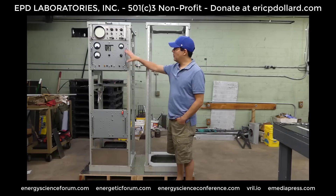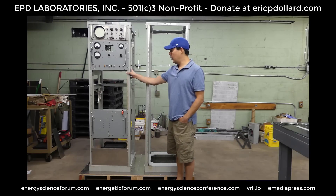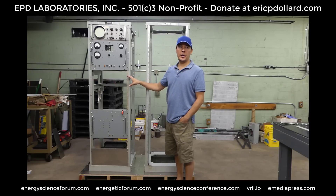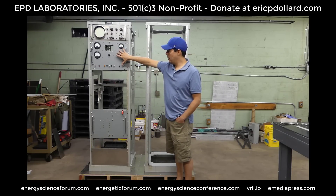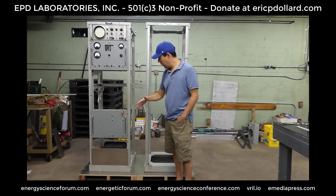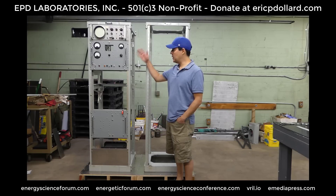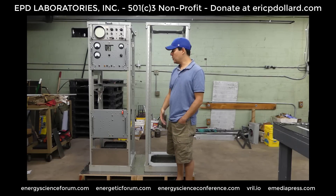This side was originally intended to be a complex waveform generator, but high power and really high voltage, where you start with a signal generator putting out a sine wave, square wave, or whatever waveform you want. That will be amplified by a 30-watt amplifier in one of these sections, which then feeds into this unit with two 810 tubes. When this is coupled properly with the high voltage rectifier, that goes to the high fidelity output transformer — essentially a very high power, near-distortion-free, military-spec audio modulator unit. The output of that can go to plates to experiment with electrostatic water splitting.